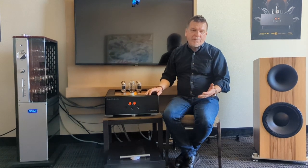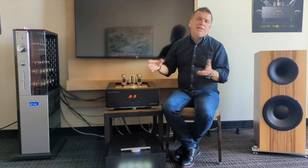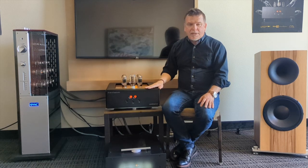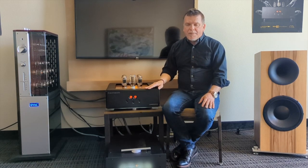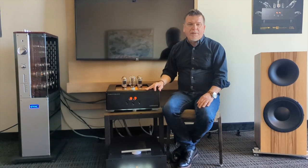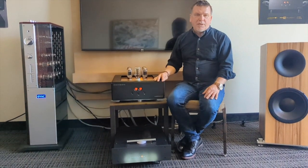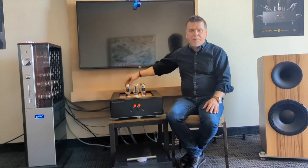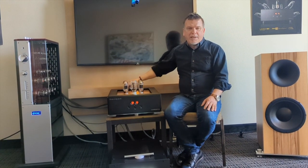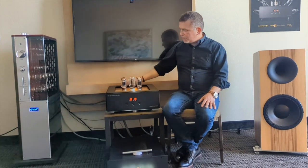And then glass cables can go up to 25 miles, so let's say it's infinite for our purpose. So Toslink is a very nice connection. I like Toslink. I'm much less against Toslink than most audiophiles who think that it's inferior. My measurements, my testing and my listening sessions show that it doesn't have to be inferior if the input is designed correctly, with high-speed power supplies and a very good optical coupling port.